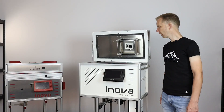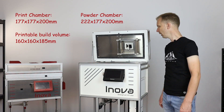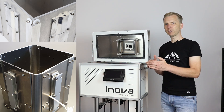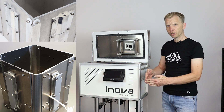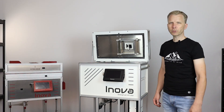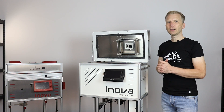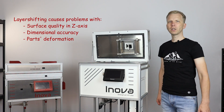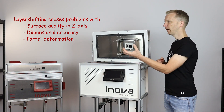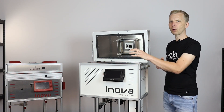The first design change I'd like to point out relates to the powder reservoir and the print chamber shape. Although the overall dimensions of both chambers stay the same as in the first prototype, I had to make rounded corners inside them because of problems with sealing. If you have a really tight corner it's problematic to seal it perfectly and to avoid powder leakage. Powder leakage is problematic not just from the perspective of mess, but also because it can cause layer shifting while printing — similar to how sand escaping from a box causes everything inside to shift.